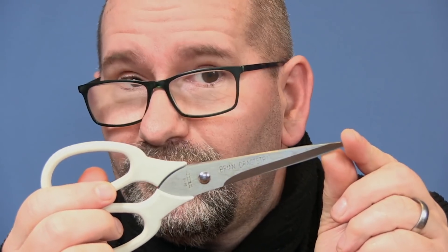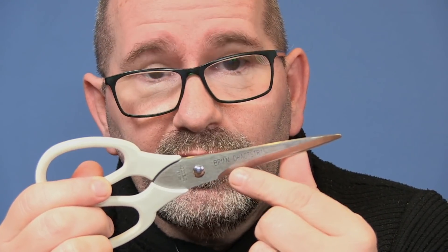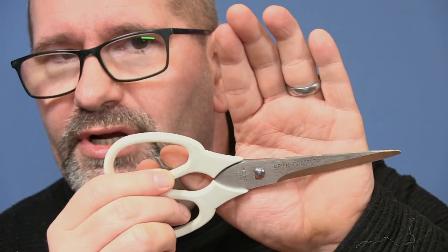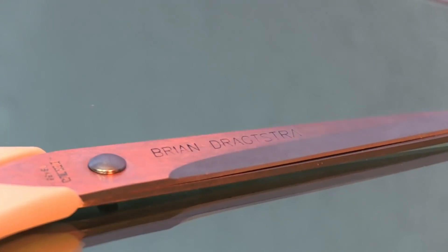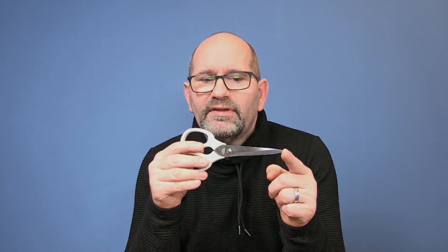When I take the scissors off the bed, you can see they are perfectly engraved. The camera should focus on it — it's nicely engraved into the metal. This is what's possible with a 15W laser. It was the mustard that made the difference, helping the laser get deep enough into the metal to engrave it.